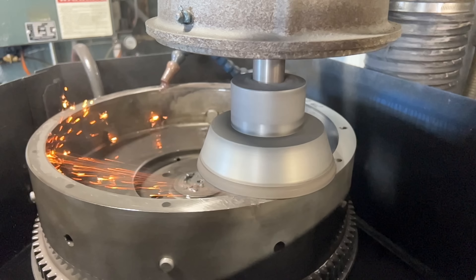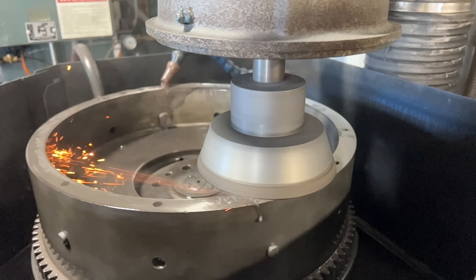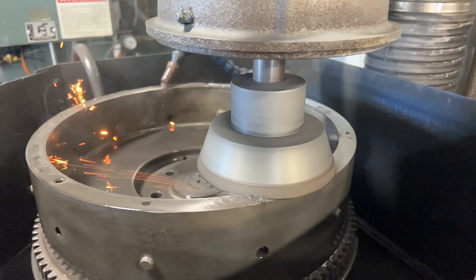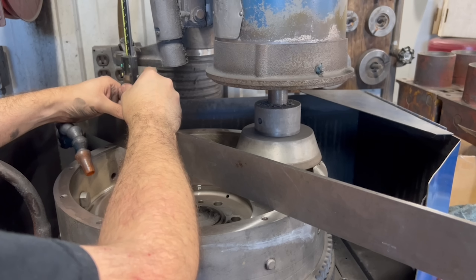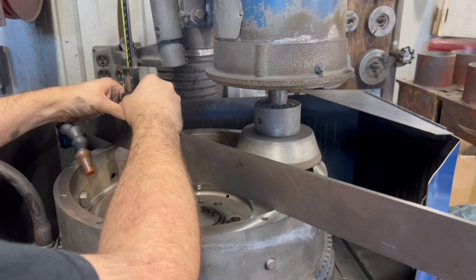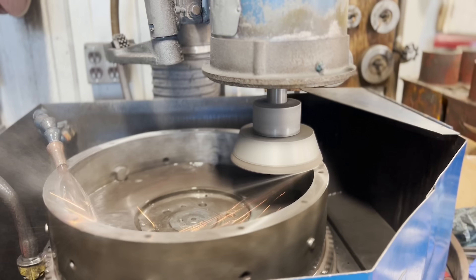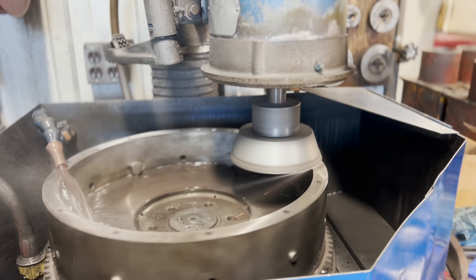By taking note of our measurement and doing a bit of quick math to the middle of our specified tolerance, we will know the exact amount of material that needs to be removed from the top step. While the machine does have a scale supposed to show increments of one thousandth of an inch, I still prefer to sneak up on the dimension so that we don't overshoot. Even if we did overshoot it wouldn't be the end of the world, but it would add work as we would be forced to move the grinding wheel back to the lower face and take additional material there.